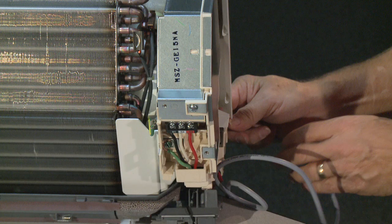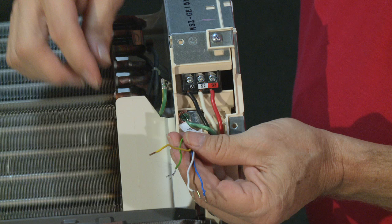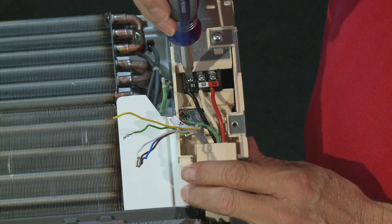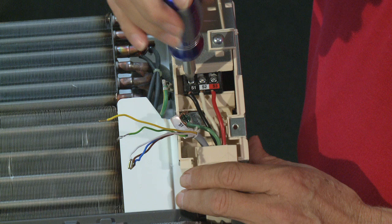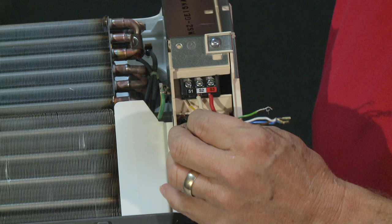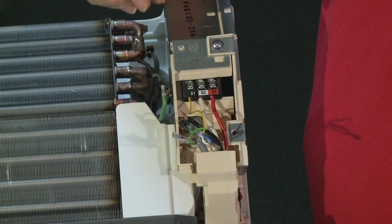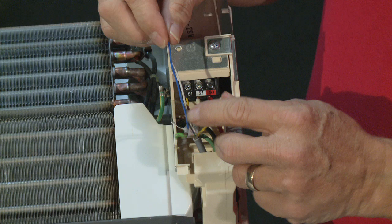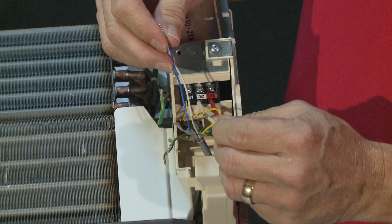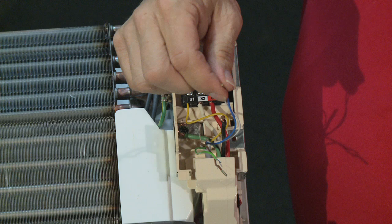Follow the same place the wire goes in from the power coming in from the outdoor unit. Once you push the wires up in there, pull them to where it's stripped back to make sure you get all your wires in. The first step is to break the S1 wire, because that's the wire that needs to be broken on safety. Take the yellow wire, remove the black wire, and install that yellow wire in its place, because that yellow wire comes from your contact.